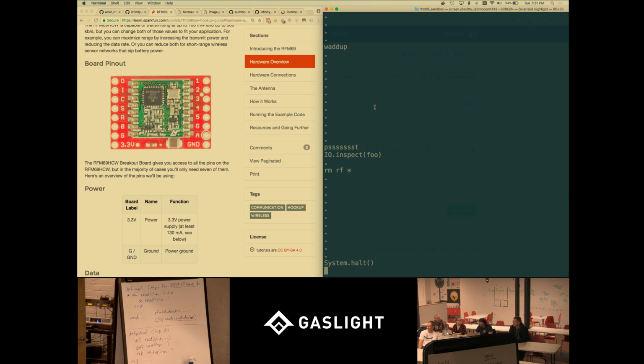So it's also kind of a broadcast, right? So whoever sends it, people are picking it up. If everybody was listening on the same frequency, and that's one of the things I demoed at the beginning, although I don't think I got multiple receive. Did I do all of them on the same frequency? So if you can set like three receivers on the same frequency listening and one's transmitting, they can all hear. You'd have to figure out the negotiation of when to send and when to receive, but for the most part, you could have a one send, everybody receive kind of approach. What might be really cool to try to do?